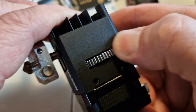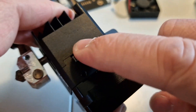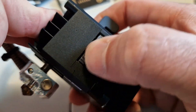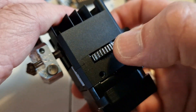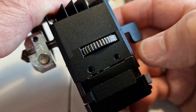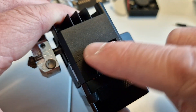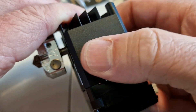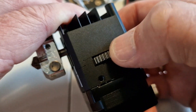I did suffer from the clicking issue, although I didn't notice any print flaws — it printed well. I just lowered my retraction feed rate and it was fine. But now the clicking's gone. That thing's solid in there, and it turns very freely with no resistance at all — well, except for the motor and gear resistance, but nothing extra. Just now it doesn't click.